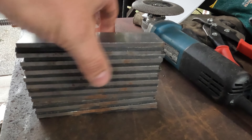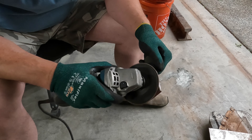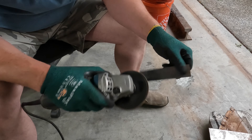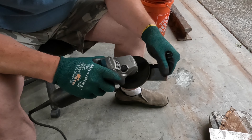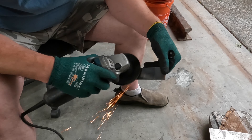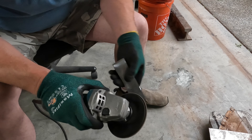When you're making this type of Damascus or pattern welded steel, you cannot have any scale. All the scale has to be removed. Any dirt has to be removed. You'll see here I'm grinding off just a little with a flap disc very lightly, cleaning off any mill scale, any corrosion, any type of oxide layer — anything on that surface.